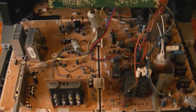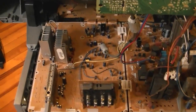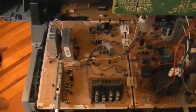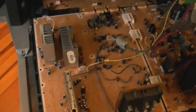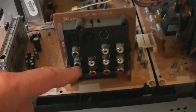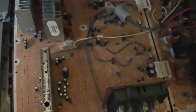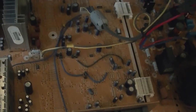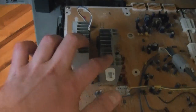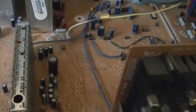I've seen the insides of a few other modernish color TVs, like my old Sony Trinitron 27-inch from around '99, and it just had like 1/3 of the circuit board real estate that this set has. I imagine some of this is to process some of the input options, like this can do component RGB input. Of course, there's also not a whole lot on these boards, just a whole lot of electrolytic capacitors and jumpers that I can see, but not many active components. Not on this board anyways, just obviously these two big heat sinks here and the RF tuner.